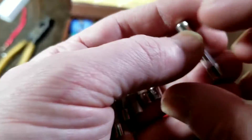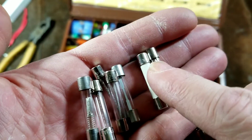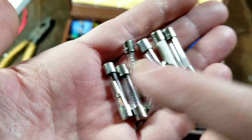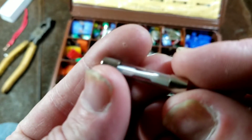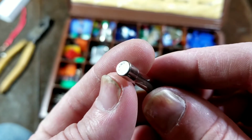When they take higher amounts of current, they have thicker rods. The amperage rating is true if you get something decent like Bussmann or Littelfuse — Littelfuse will have their little LF, and Bussmann will say BUSS. If you get real cheap ones, they won't have any manufacturer marking, but they will always tell you the amperage rating.